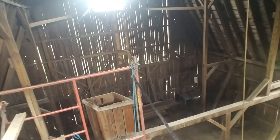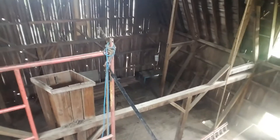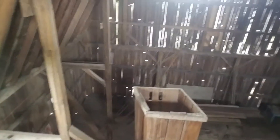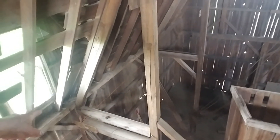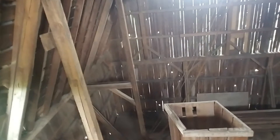The way this barn was designed it had some flaws in the engineering, shall we say. Most structures have a tie beam that goes through the middle of the building, and that helps to hold the walls in place and resist the downward pressure of the roof. This one was built kind of at the end of the timber framing era and they actually started using some steel rods. You can see one down there — the horizontal one — and then there's one that follows that timber up to the post, and it didn't really do its job. The roof is bowed outward and there's a huge sag in the peak of the roof from one end to the other.